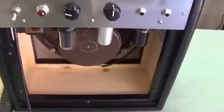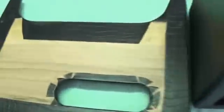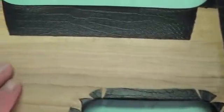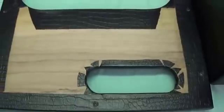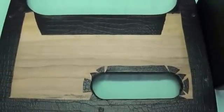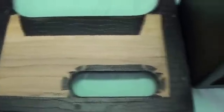Here we are with the back off the amp. The construction is my usual finger-jointed three-quarter-inch pine. For the back door and the speaker baffle, I use a fairly high grade of birch half-inch plywood. People have asked me, do you use particle board in your amps? And I said, do you ever use a soup spoon to scoop out your eyes? It's about as likely. I really have no use for particle board - as far as I'm concerned, it isn't even very good kindling.